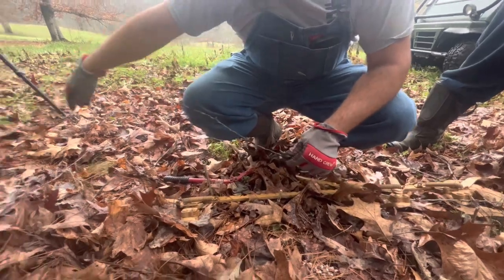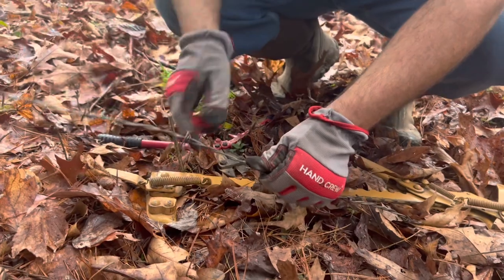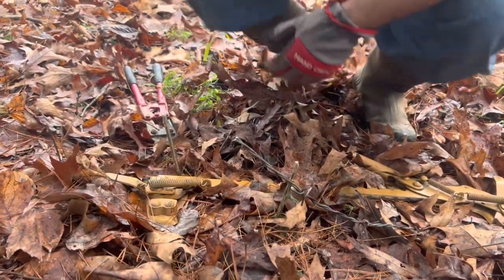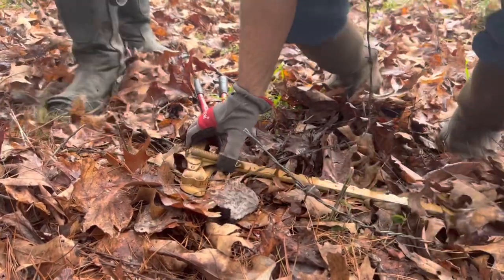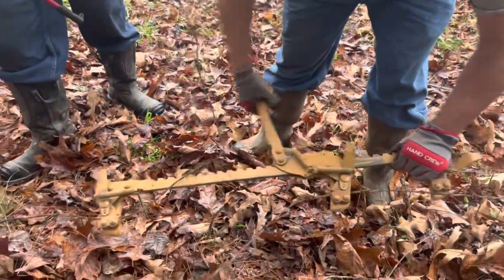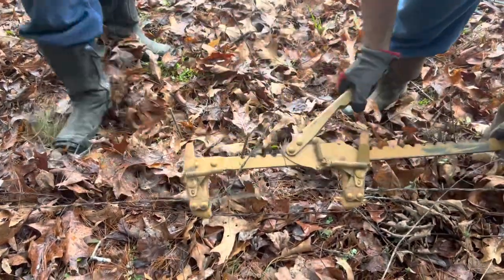There's going to be another piece of barbed wire and we're going to tie these two together. On this one, going this direction, you want to cut it off right at that bar. Cut that off, take your other piece of barbed wire, pull it nice and tight, close it, and then take your golden rod and start ratcheting until it starts getting tight.